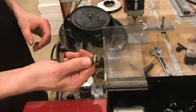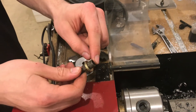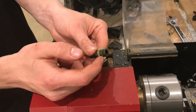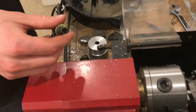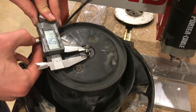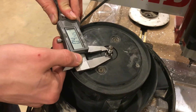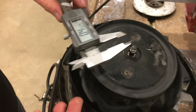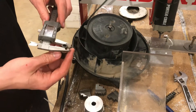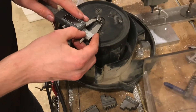I've pressed these washers between a socket head screw. I chose a socket head screw because it'll allow me to remove more material and won't get in the way, since I need to take the diameter down. A rough measurement with calipers in inches suggests if I make this about 0.45 inches it should fit nicely. The socket head is about 0.46 now — that'll still fit, so that's fine.